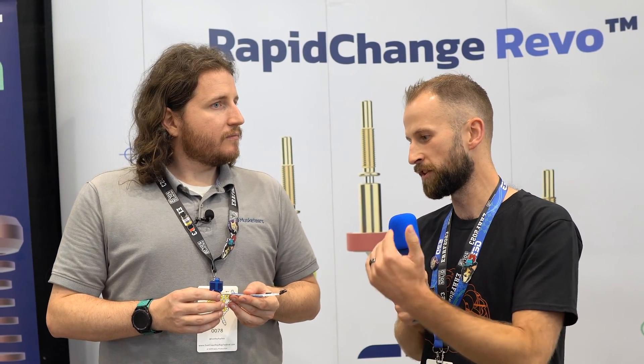They called it the Panda because pandas eat bamboo - a lot of fun. For limitations, at the moment the P1P series has different connectors; for the X1 you'd have to change the crimps out and then you'd be able to fit it. In terms of fitting all your Revo Diamondbacks and Obsidians, they all just drop straight in. On diamond nozzle printers those nozzles feel pretty much indestructible - perfect for a fast printer like a Bambu.